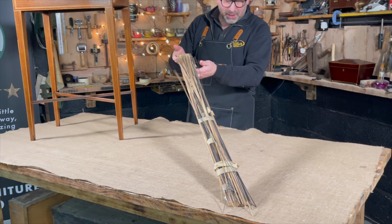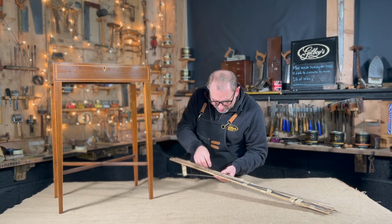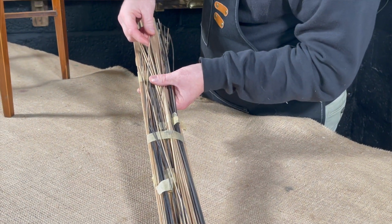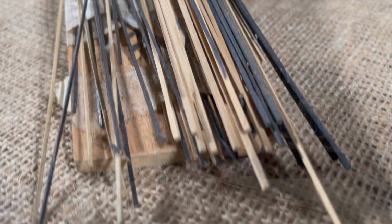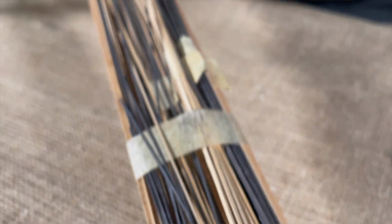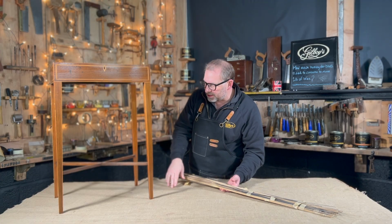We keep it on a flat board for obvious reasons, because it will break. So if this is boxwood, I'm going to select the right appropriate size of boxwood stringing and cut it to the right size and glue it in with our hot melt glue. And then I'll prepare the area. And then we'll look at just colouring in these other areas so they all tie in nicely.